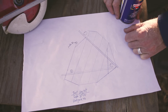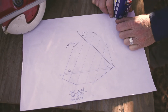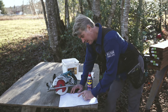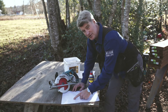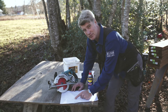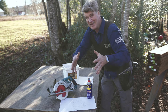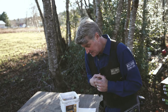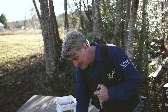I use pressure treated because in the end, especially in the northwest, you're going to get a lot of moisture that's going to sit there for a while. So I do recommend you use pressure treated joists and beams. We're going to simply place them on top of the beam, then roll them up on edge, and do the first process which is the blocking in between. This is what helps us keep these joists up and strong while we build the platform. So Henry and I are going to grab that first joist and start rolling the rest of the joists and blocking as we go.